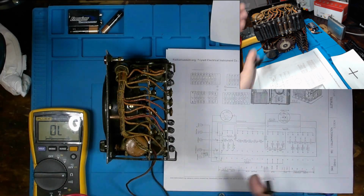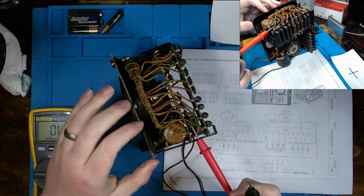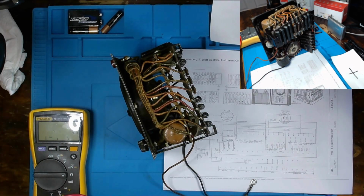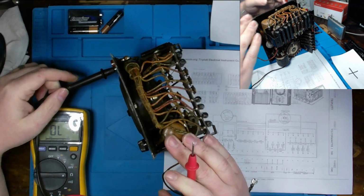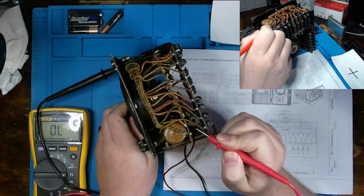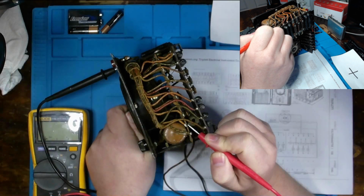But we need to know, what is the max voltage if I have leads sitting in here that will make use of that resistor under measurements, that way we know what the power rating should be for that resistor. There's a way that we can go about it. What I'll do first off is put my negative probe, now I've got this in a resistance measurement, as you can see there, into the common on the front, essentially the ground or common, and we can cycle through our switch and the top pin to this resistor to see where we get connectivity, and you can obviously see it there.